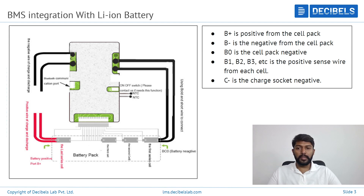At the top level, you have B-, C-, and then a communication port. A communication port is found on a Smart BMS. A Smart BMS has a Bluetooth communication port where you can monitor your battery status and life. You can also control or change the parameters using this communication port — any changes made will be communicated via it. There are also NTC sensors, that is thermistor sensors, to monitor the thermal state of the overall battery pack, along with an onboard temperature sensor.